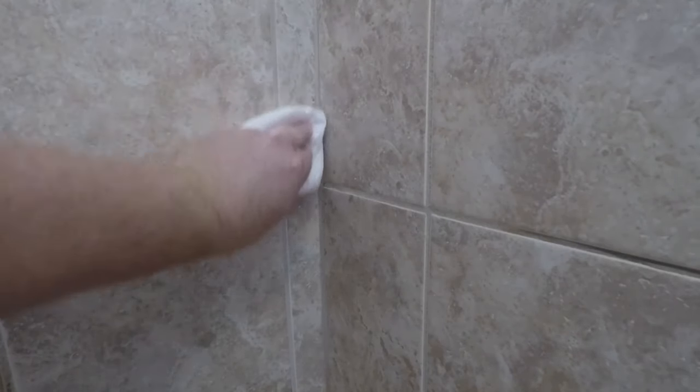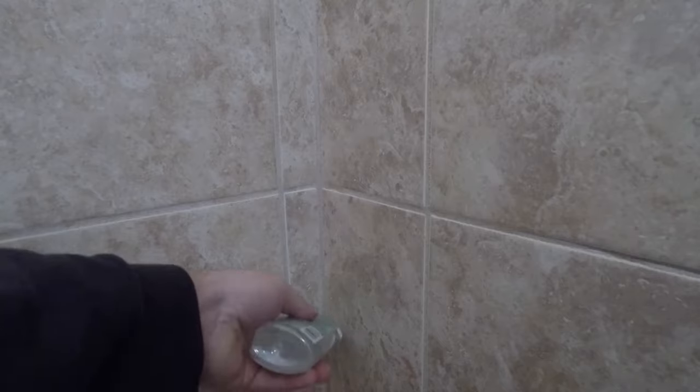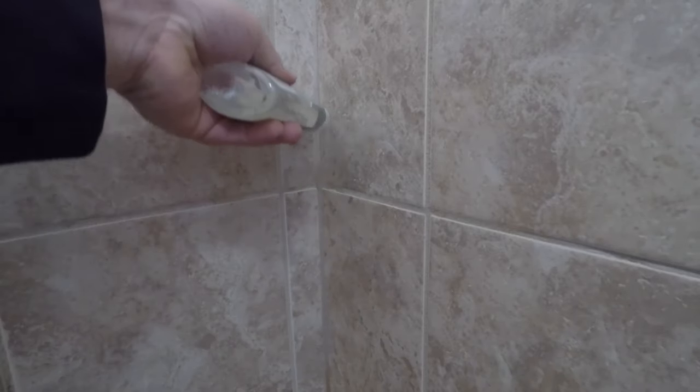It's been about five minutes. Now we can just wipe off any excess that's on the tile and let this sit for another 30 minutes. We're going to apply a second coat. Now we're just going to put on our second coat — repeat the same process we did for the first. Apply a liberal amount, let it sit for five minutes, and then just wipe off the excess.